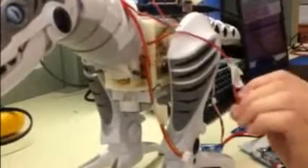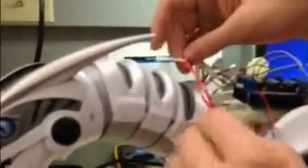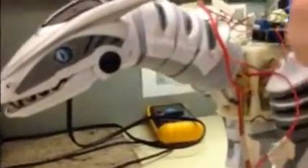I started putting the components into the board. Each one will actually control a motor — this one controls the back, and this one controls the leg. The green wire is the ground and the red is the power for most of the motors, except for this one where one is red and one is orange. This one controls the neck so it can move around. There are more motors than motor slots on this motor shield.